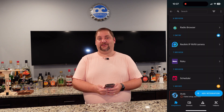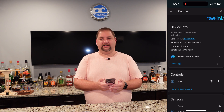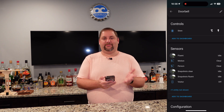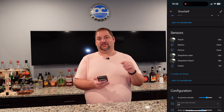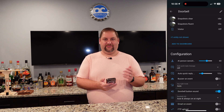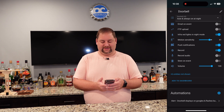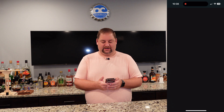I'm going to show how I have Home Assistant integrated with the Reolink video doorbell. I'm using the standard Home Assistant integration for Reolink, and within that we have the different devices including the doorbell. You can see all the information — the siren, different camera feeds, and different entities such as motion, person, and the doorbell press, which is called 'visitor' in the integration. We have everything acting on the visitor entity turning on — so when somebody presses the doorbell, that triggers all kinds of settings.